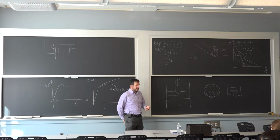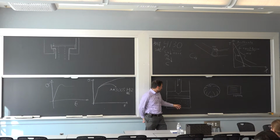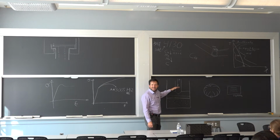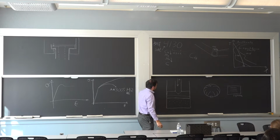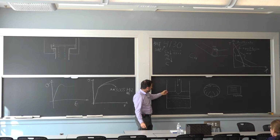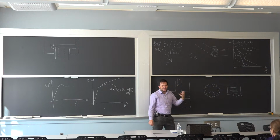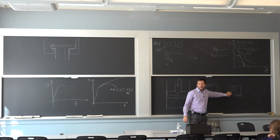It was a little bit more of an academic exercise because the problem here just led itself to that it did fail in fatigue. Also, the very, very small size of the final fracture speaks to how little load was applied in there. And I think it also says that it was a little bit of a bending load. If it was just really a straight pull, in order to initiate at these different locations, you would have a bigger final fracture. But essentially, if you have more friction at one specific zone around the entire circumference, you start getting some particle buildup here, then this is where your bending moment starts, and that's why you only have one initiation as opposed to initiations all around. So there's a lot you can learn relatively quickly without having to do that microscopy study here.